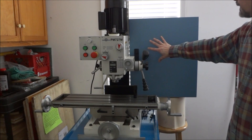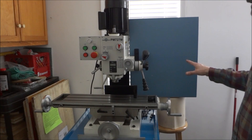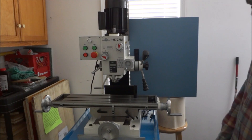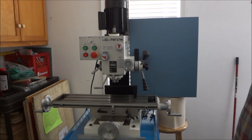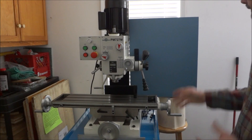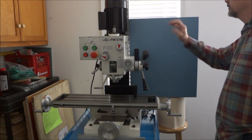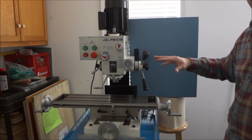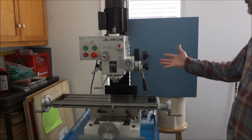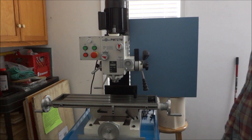I also don't like the fact that this panel weighs a good bit, and once I get all my electronics in there it's going to be pretty heavy. I don't want the mill to be unbalanced. I do have plans for an automatic tool changer and a monitor on a swivel, so that'll add weight — I can probably balance it out. The third concern is vibration. Vibration and electronics really don't go together, so both the back and side positions give me some concern. I don't expect much vibration during normal operation, but when you're cutting you can get chatter if you're pushing the mill too hard.